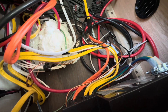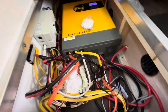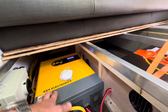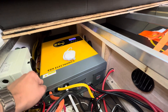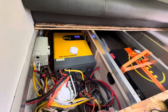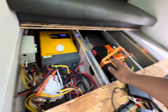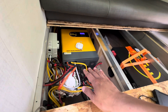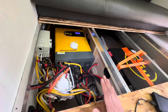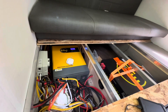So it interrupts the main line coming in, which is what you want if you want to power everything. When you're plugged into shore power and not getting enough solar, you can alter the settings on the inverter to rely on grid power. And you can turn it off to rely on solar power, which is nice because you can charge your battery while docked with shore power. Or if you need a boost, or if you want to use a generator, you can recharge your whole system that way as well.